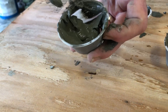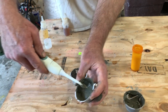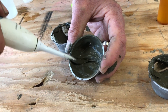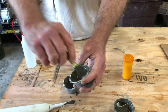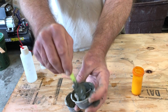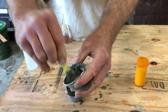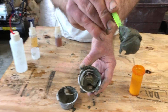And you can do this again in a half hour and do the same thing. Here's the Delvo mix — same idea. We get the stuff to water back down with some vibration. And after it's been vibrated it actually is more dense and it seems to stiffen it up. Same thing with pumping — if you're pumping it under high pressure you lose some slump too. See how we get those little wisps to stand up there.